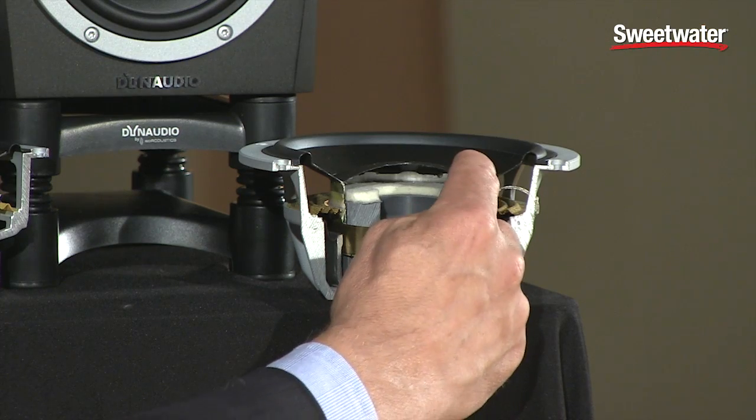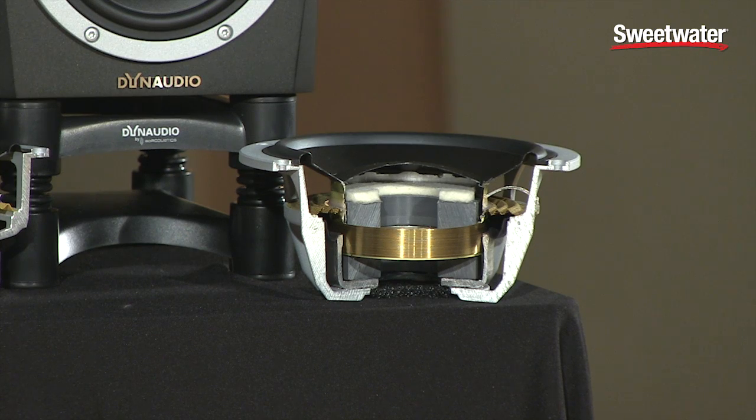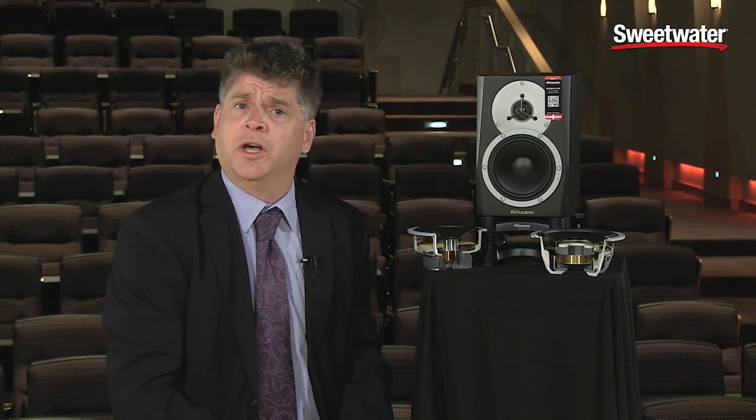the actual mass of the voice coil is less than what a traditional voice coil is in a smaller form. The advantage of being around the outside of the magnet as opposed to inside is there's much more uniform magnetic field. Even as the driver goes through massive excursion, the consistency of the magnetic field means that the performance and the audio you hear, even at low to high volume, remains constant. Whether you play them at low volume or high volume, they sound consistently good — the sound doesn't change.